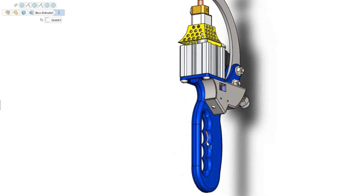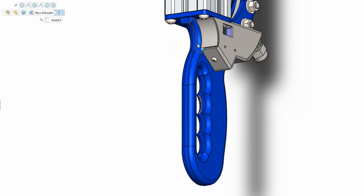Oh yeah, just talk about this 2 seconds. I don't think I talked about this. This is routed using the wood router. This nice radius, it's 10mm radius. But first of all, you will see in the pictures that I square it up as square as possible first. So these 3 plates are welded together and sanded 90 degrees off each other. So this face is perpendicular to this face without the radius. Then I wood router the whole thing without this plate on it, obviously.